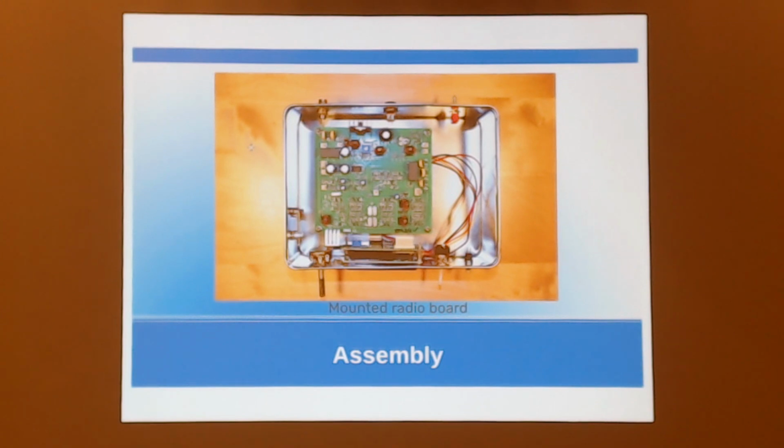So one of the things I was worried about was how to protect the radio, because it's very easy for the kids to break. In fact, I had budgeted 2 radios to give away to the kids. One to give to them, and you tell them, don't build it until we get together in the workshop. And of course, they have to build it, and they'll break it. So they were motivated to pay attention. So I saw on the BITX20 forum, which all this comes from, the protection was to put in a 2-ampere slow blow fuse. I said, slow blow? No slow blow here. We're going to do a fast blow fuse. So one of my fellow mentors, Mark N4DR, accidentally showed that it blew the fuse and not the power transistor. So we have some protection there.